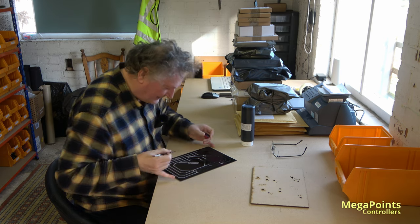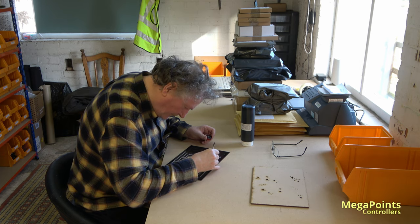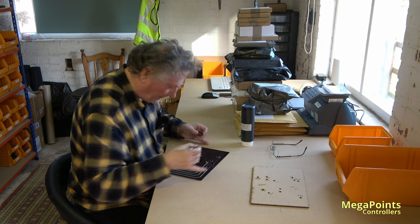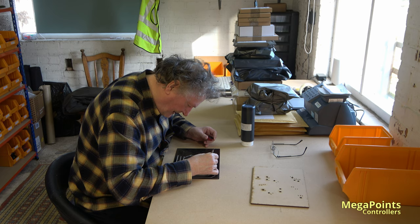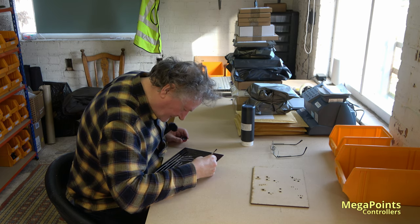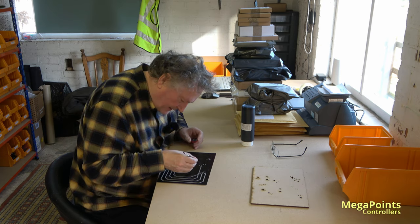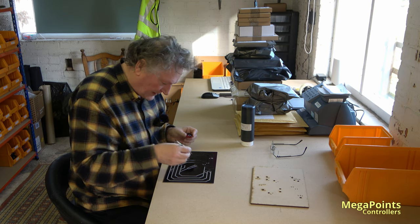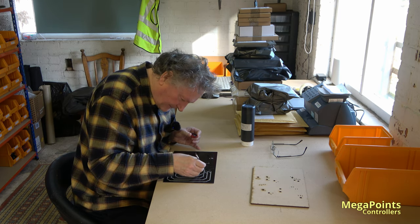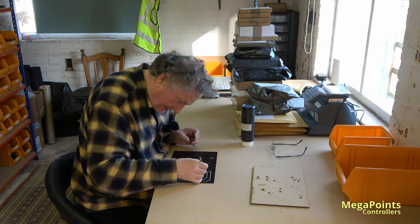If I'm taking a lot of material out in a tight space, I tend to reduce the depth of the engrave. But when you reduce the depth of the engrave, the colours don't come out so well, because they're more absorbed by the plastic in front of it. If you get the balance right, then the panel looks good and everyone's happy. And I think this panel looks good. And I hope the customer's going to be happy.